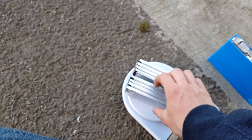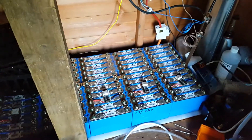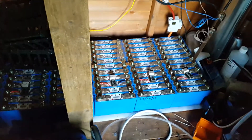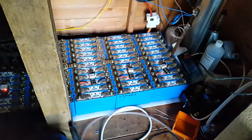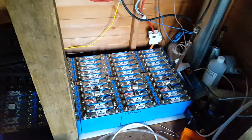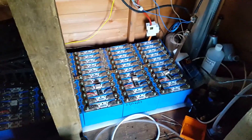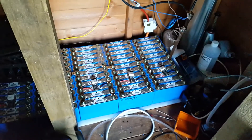Just a little comparison there. Currently these are still doing really well — they stay in balance very well and I've never had them reach a voltage where my balancers have activated. I've set them to activate at 4 volts per cell to keep things down at 4 volts. I'm charging the car right now with the solar power stored during the day, and it's still working fine.